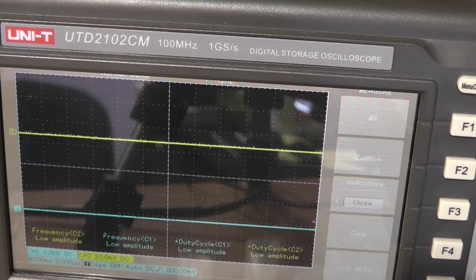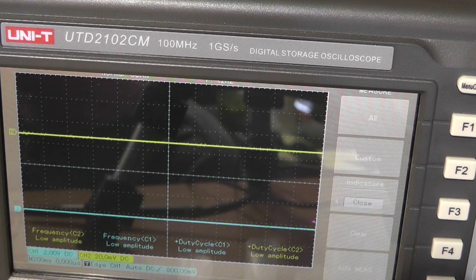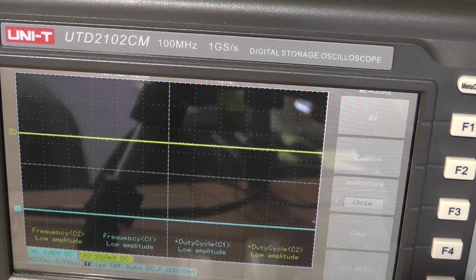So now if I connect the circuit, what you're going to see is every other pulse on the blue, the yellow will have a spike. Now the yellow does have a small spike, but it's not a full spike, and it is not actually sparking, even though you can see it, because it's such a defined signal, it's very sensitive. So watch what happens. You'll see a very deep, low spike every other time the motor makes one revolution.